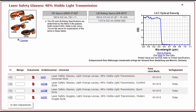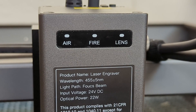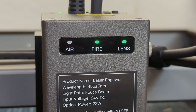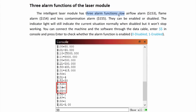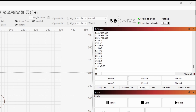Don't buy the cheapest — good protection is never cheap. On the front of the laser head are three LED monitoring indicators labeled air, fire, and lens. They inform about the named operating condition with their color going from green to orange to red: green means everything is okay, yellow indicates a state needing attention, and red indicates a probably serious problem. If the machine stops on a red condition is determined by settings 153, 154, and 155. Check their values by sending $$ using the command line in Lightburn or LaserGRBL, and enable them by setting to 1 or disable by setting to 0.